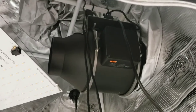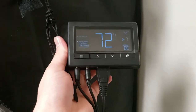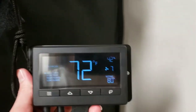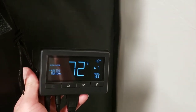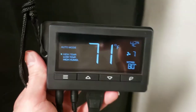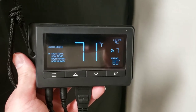Another great feature of this unit is a separate line that goes under and plugs into the fan unit — that's actually how it controls the fan. If the humidity level is getting too high, it will kick the fan up. The fan is on setting 7 right now and has higher settings available. If humidity is a little low, it lowers the fan setting so humidity builds up. Same with temperature — turning the fan up will bring the temperature down. I'm very happy with this and would recommend it to anybody.